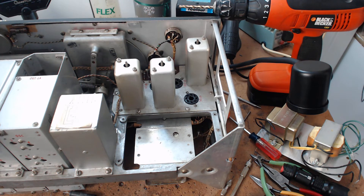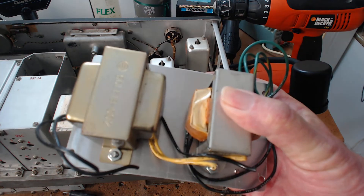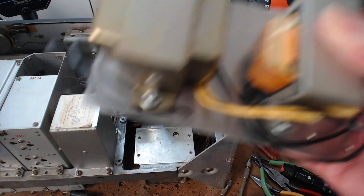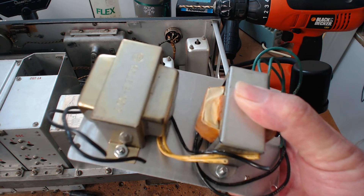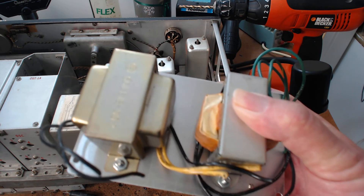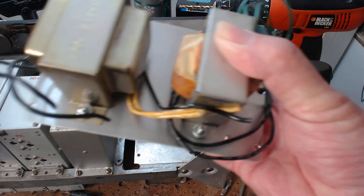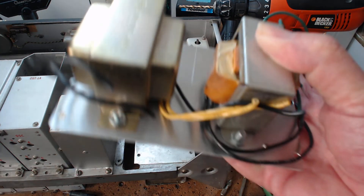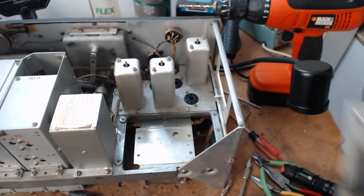I'm hoping this all works. On my command radio I take one transformer and feed it into another one backwards and it worked fine, but I can only get 160 volts after the full wave bridge and capacitor. I'm hoping to get up closer to 200 volts with this. I've left the holes drilled so I can swap out the transformer - I've got the measurements of the hole distances, the whole thing.